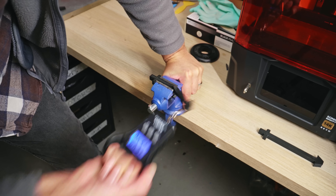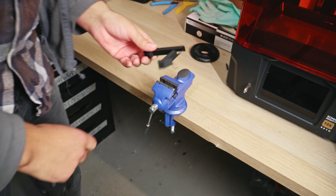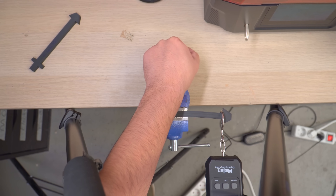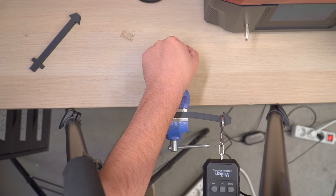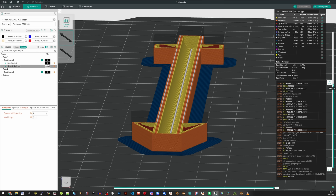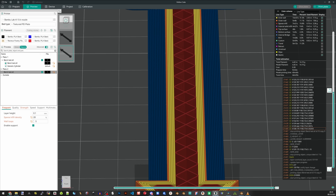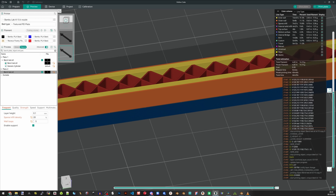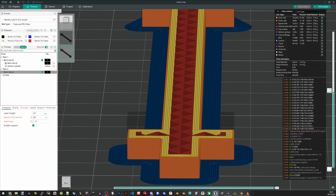I tested a lot of these, and we got very little variation in their breaking point between hollow and normal — like very little. The same goes for deflection: at the same force exerted, you get the same amount of bend, despite the hollowness. But why? It's hollow — it should just snap. The other test part even has 20% infill, and this one's got nothing. It really shows how very ineffective infill is when it comes to a bending test.